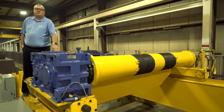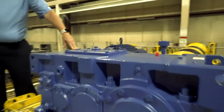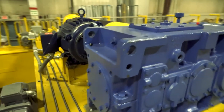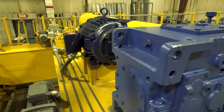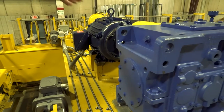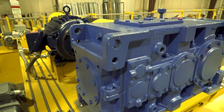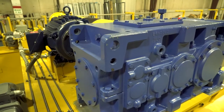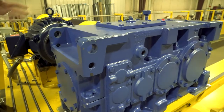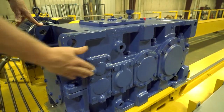What we're looking at here is our standard GW Becker trolley hoist arrangement. It features, in this particular case, a commercial gearbox with a drum coupling to a fully machined double-reeved left and right hand groove drum with flame hardened grooves. This 20-ton unit has a foot mounted motor with a flexible coupling and an AC disc brake on the back of the motor. We can also configure a brake wheel for those who prefer a shoe brake on the input shaft between the motor and gearbox, or on an extension of the high-speed pinion shaft.